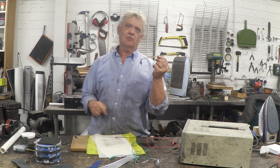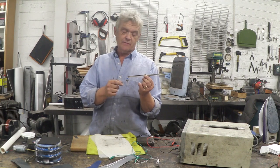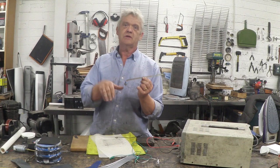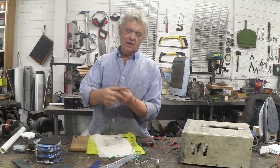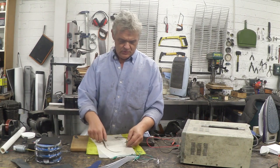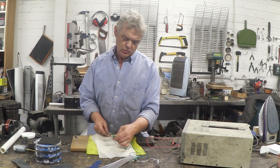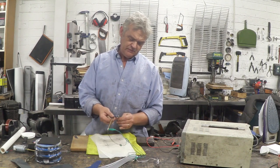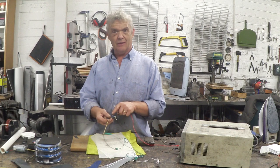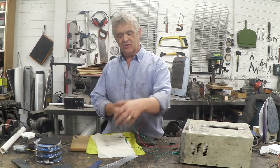I've jammed that roller bearing over a bit of bare wire. The idea is that the outside of that roller bearing should act as a slip ring, so if we jam another wire on the outside then we'll be able to turn it and yet keep contact. I've taken it up to the end here, so if I connect an LED to that and connect the earth negative to the bar, then when we touch the outside of the ring that LED should light up. We get our LED lighting - so that is acting as a slip ring, which is kind of cool. Now we can connect this all back up and stick the LED on the end.